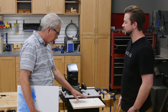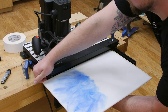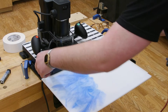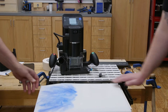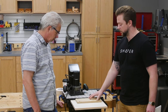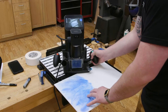To cut this clock face we're using the workstation. The advantage over just sticking tape on the piece is mainly the ability to adjust the shelf height to any height, because we want everything to be coplanar. This is an odd thickness, so we bring the shelf up so everything is nice and flush and it gives us a nice surface to cut onto.